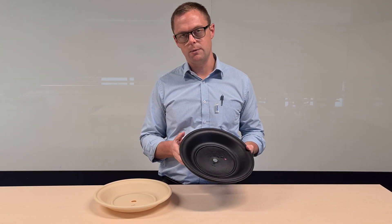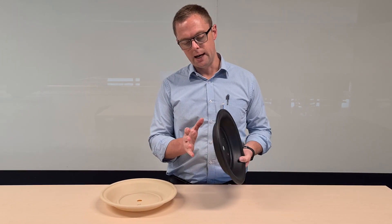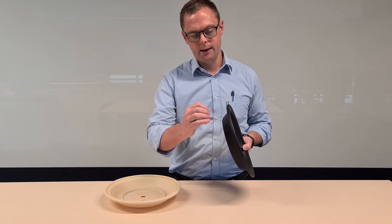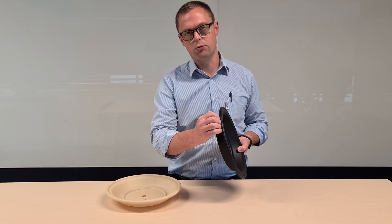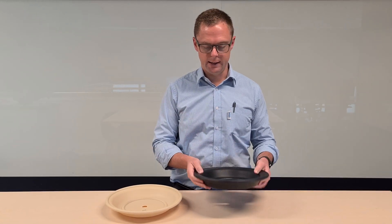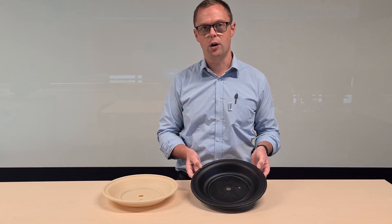One of the key points about these rubber diaphragms — the traditional diaphragm — when they're manufactured, there are essentially three parts to it. There's your first layer of rubber, and then in the middle you have a nylon mesh reinforcement layer for strength, and then another layer of rubber, and the whole lot is bonded together. So it's quite an intensive way of making a diaphragm.